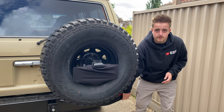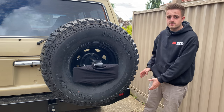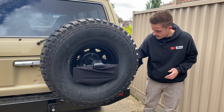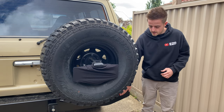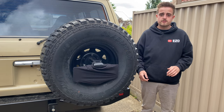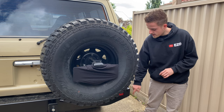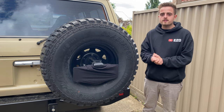The next thing I would have changed is to add a little more thickness here. I wanted a bit of a curve to give it a style look so it didn't look like just a big bit of c-section bolted on the back. I probably would have made it a bit thicker so the spindle could come down further and tie in more. It was very tight behind there with the light, so if I'd made it thicker I would have been able to brace at the bottom.